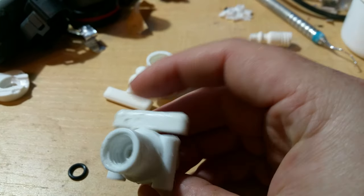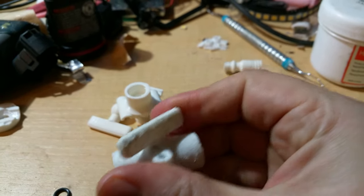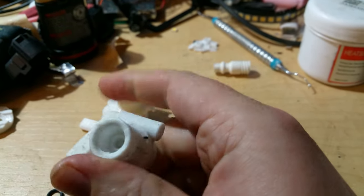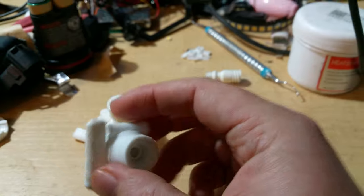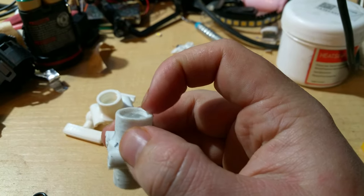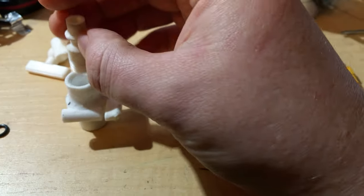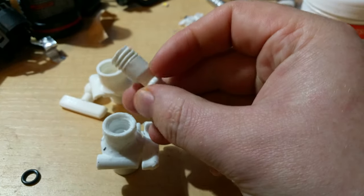This one is the very first Mark 1 that actually fit together — doesn't work very well, but it's difficult to blow through. If this was closed I definitely couldn't breathe through it. I was kind of relying on the methylene chloride to glue this together, and as I did that I rotated this so that the ball inside didn't weld to the casing plastic or PLA. These are 3D printed parts obviously. This also was a failure because when I soaked the whole thing in the methylene chloride, all the threads inside just kind of dissolved into muck and nothing was fitting. So I'm just going to keep my use of methylene chloride to the surface I want to glue together and not touch the more accurately made components.